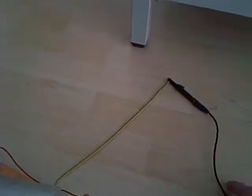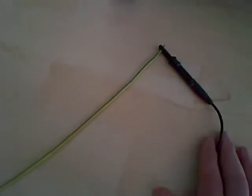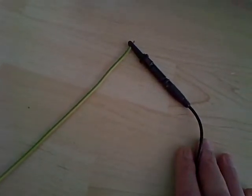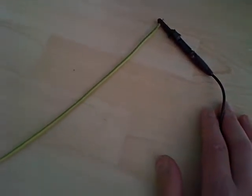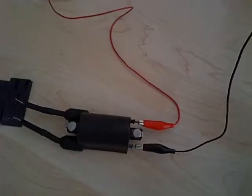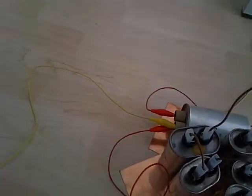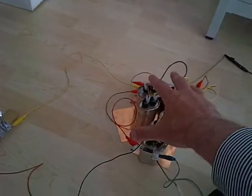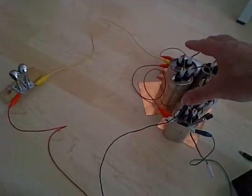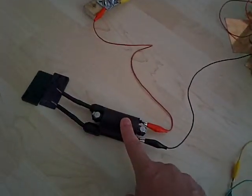And there's just one wire more. I'm always using the yellow and green one for Earth, so this is my Earth connection — a rod, a two meter copper pipe driven into the ground, and it's making quite a good contact. This bank of capacitors is in fact hooked up with one wire here, then it goes back via my spark plug to the other one. So in fact, this is just a bunch of capacitance, and as soon as the voltage is high enough, it will jump across the spark gap to this car coil.